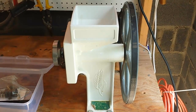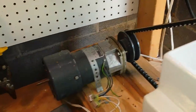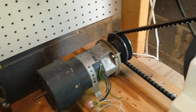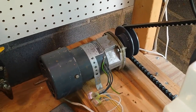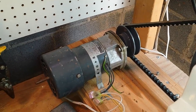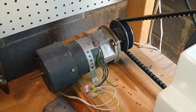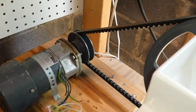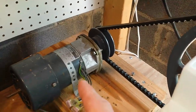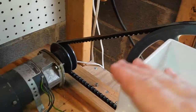This mill originally cost me about $400, and the motorization kit they sell with it is another $400. However, I was able to find a surplus GE gear motor online at surpluscenter.com and made a crude mount for it, and it's been running ever since. You just have to make sure that you understand what the RPMs are on your gear motor and what your pulley ratios are.